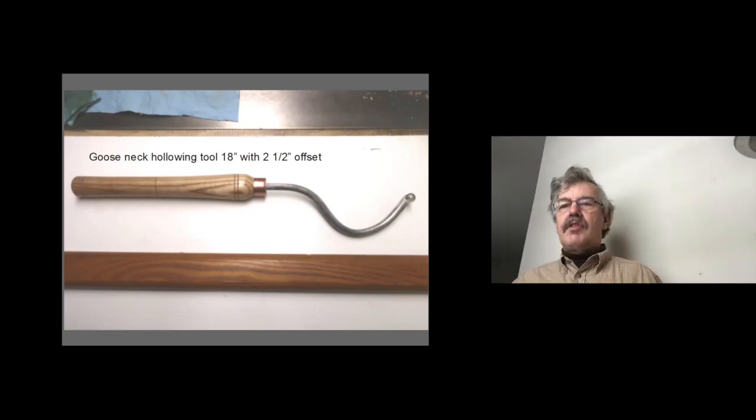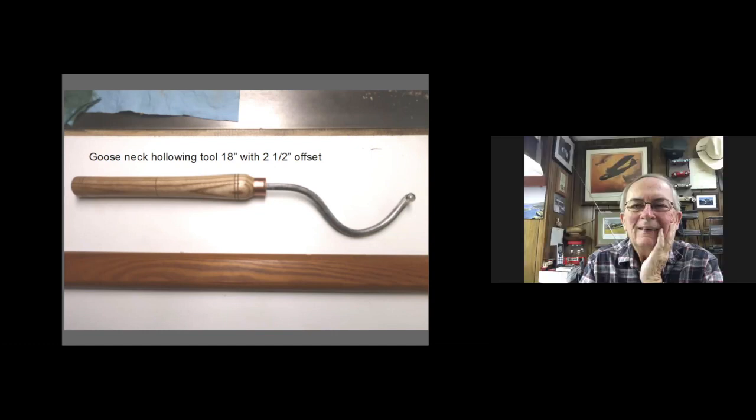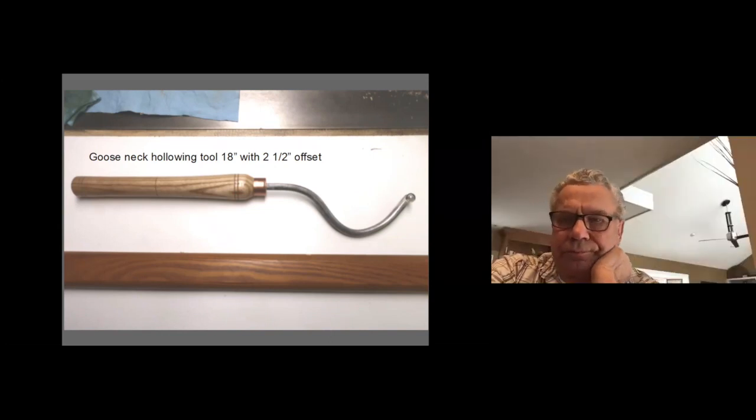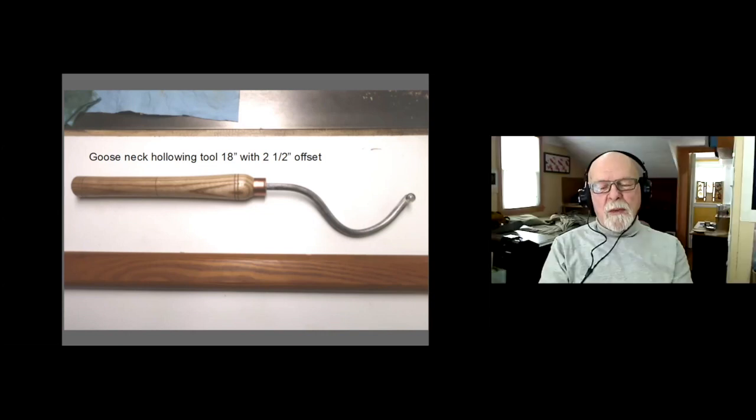Well, you've done the right thing, Alan, by making sure your tip tool is in line with the handle. That's key on those parts, to make sure you don't have too much pressure when you're turning it. The closer you can get that carbide tip to the center line of your handle, the less it'll flex, the less torque or twist. Alan, what diameter is that rod? That rod is 3/8. Then you don't want to grind it flat, or you won't have enough strength.